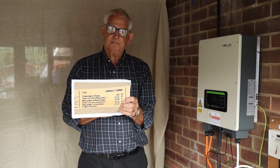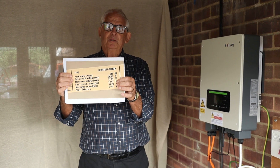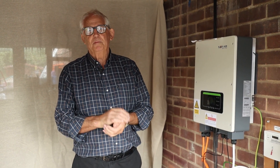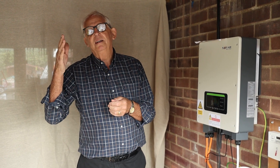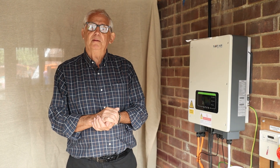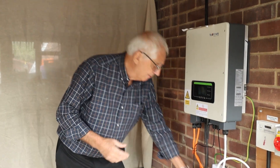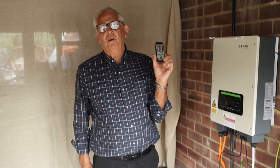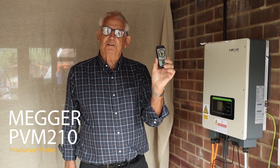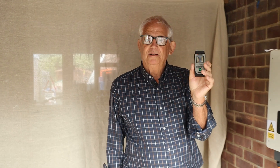When I do this short circuit test, if I'm getting 1000 watts per square meter on my panel, I'm expecting to get 13.61 amps. Even on a good day, I'm unlikely to get 1000 watts per square meter. If I'm only getting 500 watts per square meter, I'd be expecting half the current — somewhere around just below seven amps. It's not an exact science. What I need to do is measure the quality of the light, and for that I've got an irradiance meter. I've got a Mega because I know it's reliable — you can use what you like, there are lots of different options out there.